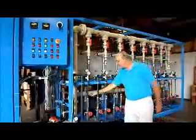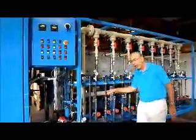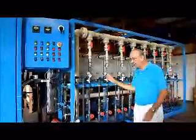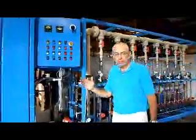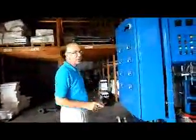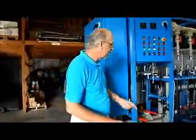But of course, because we reduced the flow down, you're not going to get as much flow as you were before. You get about half the flow from this module, and all the others are the normal flow. But otherwise, it shouldn't compromise the overall operation of the system. So that can be done overnight. And basically, because we have individual power supplies for each module, we can put this one in the maximum voltage for regeneration while all the others still stay in their normal mode. That's one method.